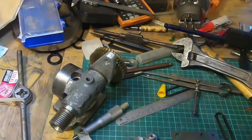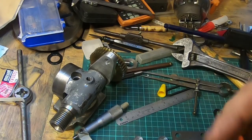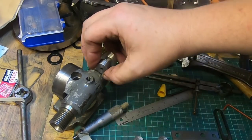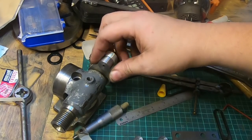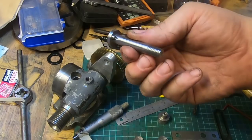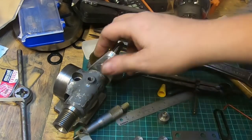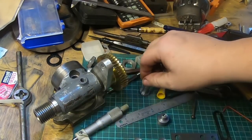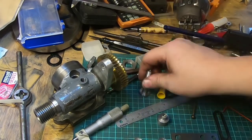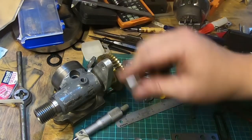I've just machined three up. They're all for different purposes. This one fits in this hole and is the right diameter to file this lever down to be a nice neat fit - a nice neat concentric circle with the bolt. It's got a dowel or a pin in there and then a keyway in the hole to stop it turning. That goes in there nicely like that. But this looks a bit ugly so far because we've changed the design and the hole ended up in a different spot. I left a little bit on it, so if we make a hard button and file that down, that'll be a nice job.